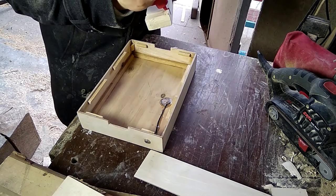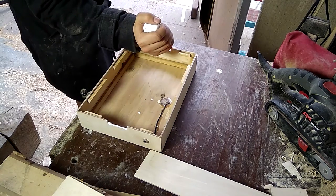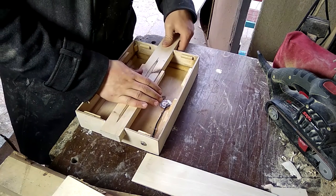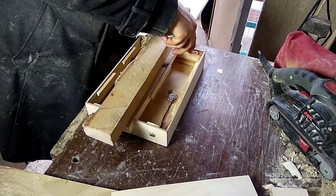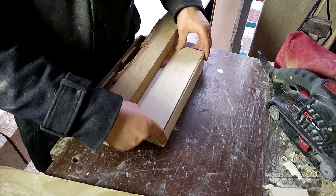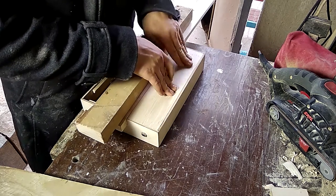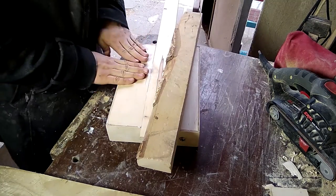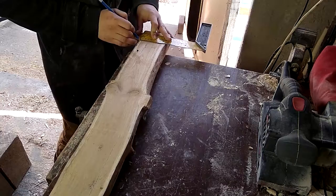It's time to glue the balalaika up once everything is ready. Apply a little bit of glue — I said a little bit. Hold on, let me clean that up. Let's carefully place the neck into the body. A little bit of force — everything's fine. Add some more glue if you feel it needs to. Now glue the front plates also, and hopefully they will fit in place. If not, you know what to do. In my case everything fits nicely, so I just push it in. Everything seems perfect — now let's put a little bit of pressure. Keep it under pressure so it wouldn't fall apart. Do the same for the other front plate. Now add some weight while the balalaika is drying up. Let's make a saddle and nut for it.